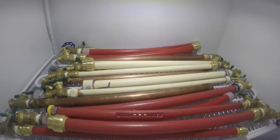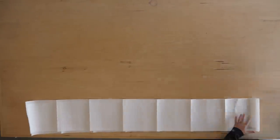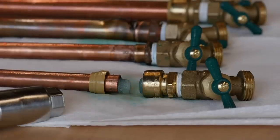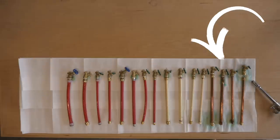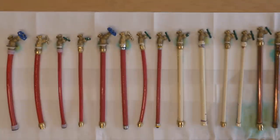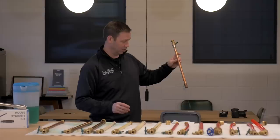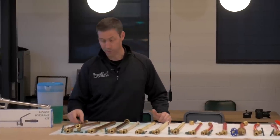Pulling the pipes out of the freezer and thawing them on paper towels, I filled these with green-tinted water so we could see where leaks occurred. The paper towels are most green over on the copper side. Half-inch copper with a sweat-on fitting failed pretty dramatically — a big bulge and a giant split. Think about if this was in your basement with water pressure on. The SharkBite connector on the half-inch copper was able to grip the pipe, but the entire fitting was blown off. Moving up to three-quarter inch, there's a pretty good-size split with the sweat-on fittings, and again the SharkBite connector blew off — though this time the connector looks intact and reusable. A close-up shows the stainless teeth dug into the copper but couldn't hold back the pressure.